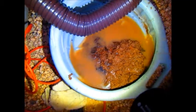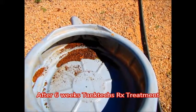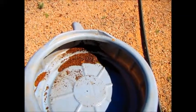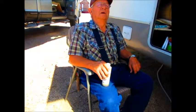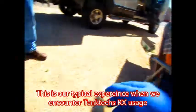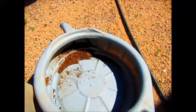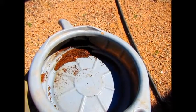We're halfway through the cleaning process. I pulled the hose expecting it to be full of struvite because I saw it coming out, but it has all broken up, turning into sand. How long have you been using the TankTex? Since about January 30th — so about six weeks. It released enough to start clogging things up, but the jetter is just shattering it and it's flowing right on out. That's exactly what it was supposed to be doing.